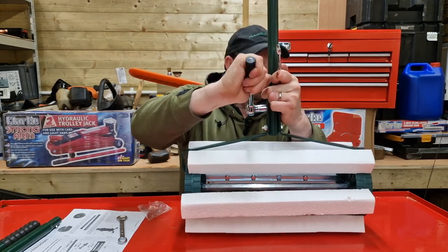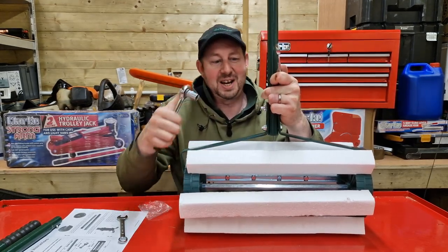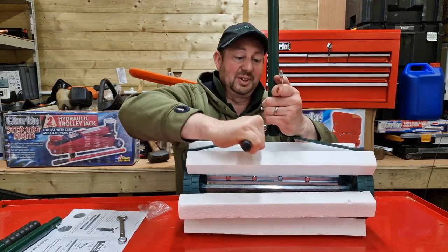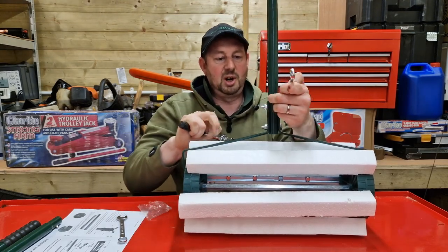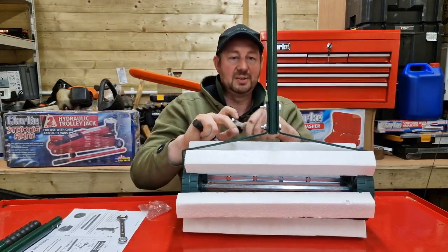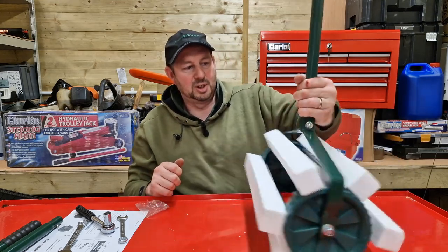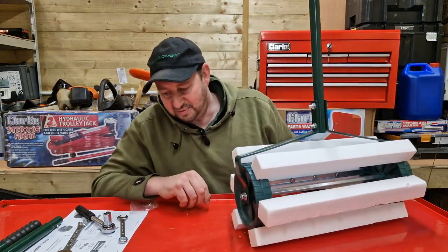That's pulled those in - they're now in line. Just tighten that one up on the top. There's a lot of threads on there - they could have used some of this extra thread from these down here and made everything a little bit easier. That's tightened up. Let's tighten the bottom one now because that will have pulled in again. Tighten one, then the other, then one, then the other until it's in there and tight. Be careful you don't go too much or you will start to strip the threads.